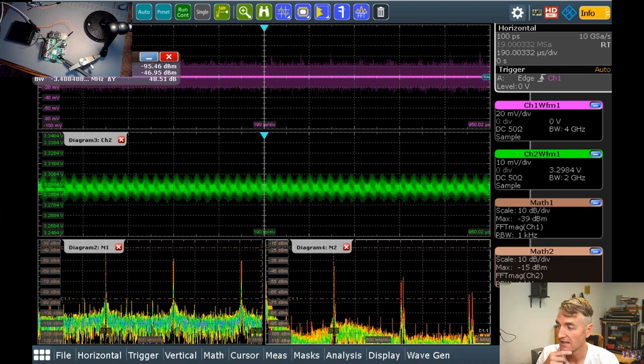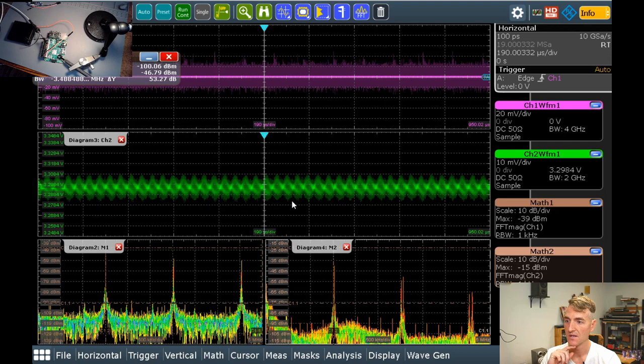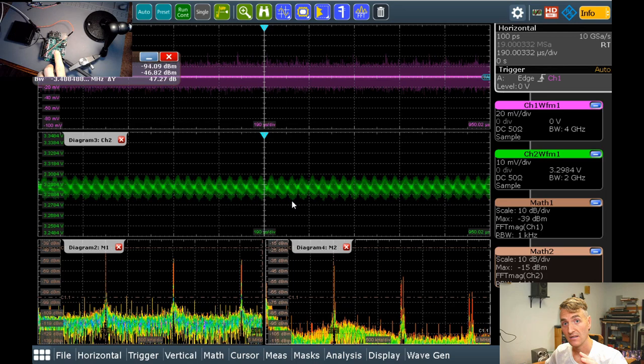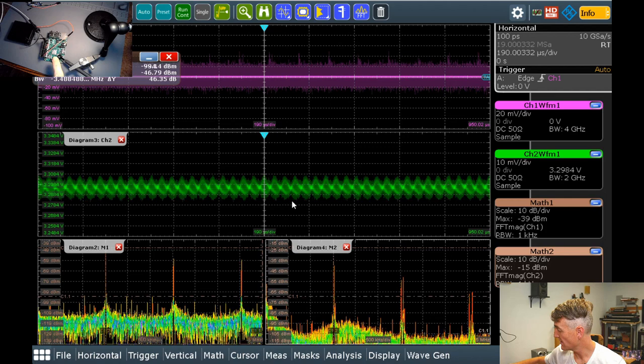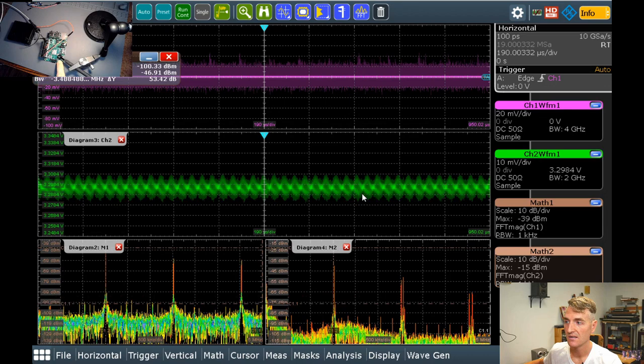I think the switch mode power supply was what was really causing my problem when I was designing my amplifier: the noise on the ground plane. As soon as I connected the ground of the Raspberry Pi to any part in my system, namely the digital to analog converter, that noise was getting from my Raspberry Pi out into the system and ultimately into my ear holes, which was negative. So I think this power management IC is causing a kind of noisy rail, but not that bad.